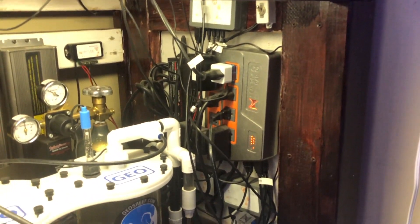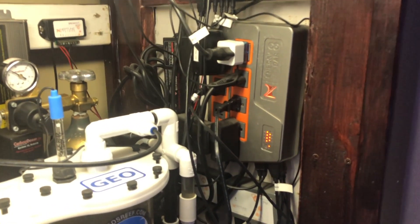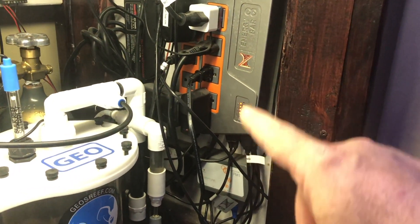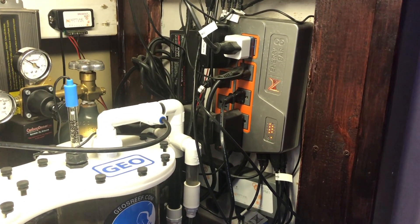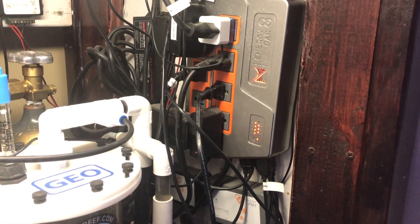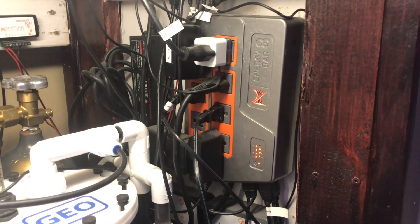So I came down here, tried resetting everything, unplugged everything, plugged it back in. Nothing I do is making it work again. However, I can control the outlets and all the little lights come on and off as if it is working. It's showing up in the dashboard as if it's okay, just not getting any power on the outlets. And when you do turn the outlets off and on, you don't hear that little familiar click of the relay.